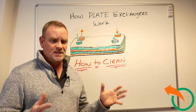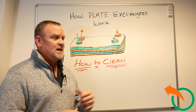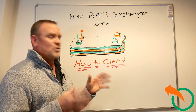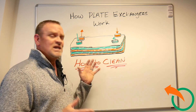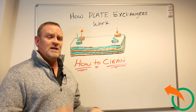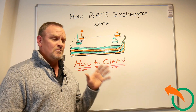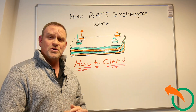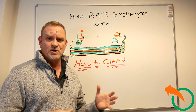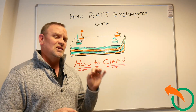They don't clean it 100%. You spend $100 to $150 to have them somewhat cleaned, and their life expectancy is half of what it was originally. So where I'm going with this, it's just easier and cheaper to buy a new plate exchanger and dispose of it. If your water has lime and mineral deposits, maybe spend the money towards updating your water system — softeners and anything else that might apply to your application.